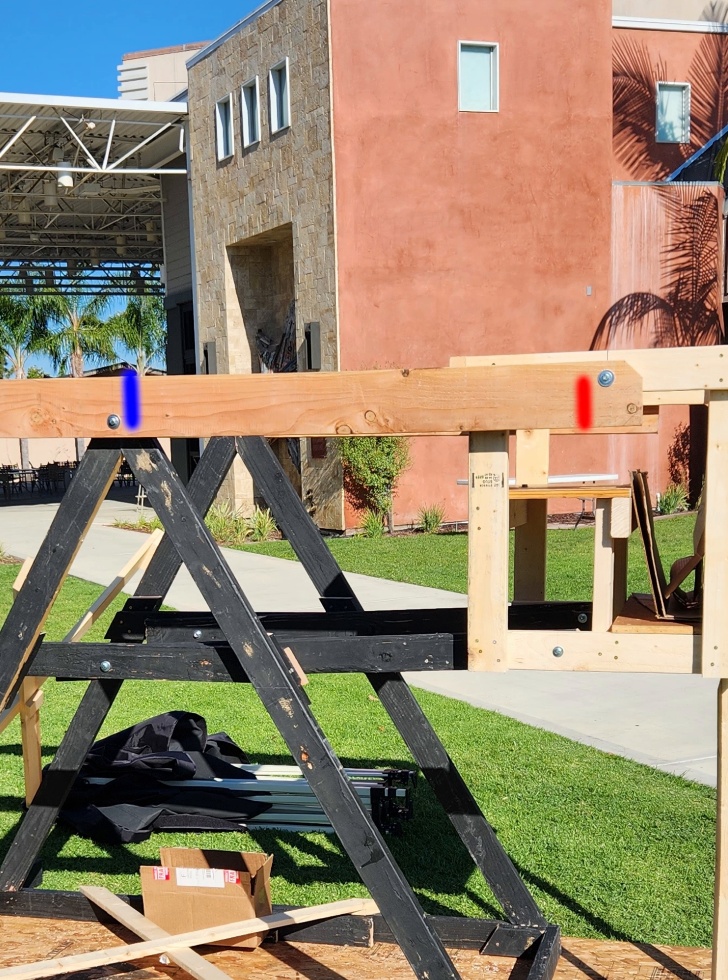In the middle of the cross beam, it was the other way around — the pivot point was closer to the upper edge of the cross beam because, being a pivot point, the strength was needed below the pivot point, not above it. Now that's relative to the piece of wood we're talking about, so that comment applied to the inner pieces of wood on the actual cross beam itself — it's the reverse of that because the forces are in the other direction.